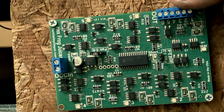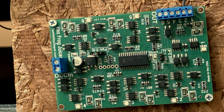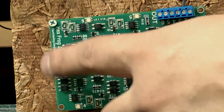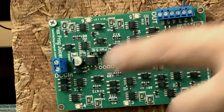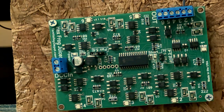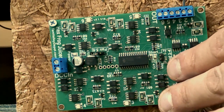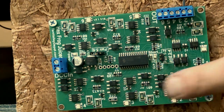That's nice and snug. Now, importantly, this unit connects to your DCC track bus — the frog outputs are for your frogs and the bus connection is for your track bus. It's a very simple setup. The hex frog juicer runs about $77–$80, but six switches for that price is a good deal. These work really well and deliver plenty of power to your frogs for smooth operation through your switches.